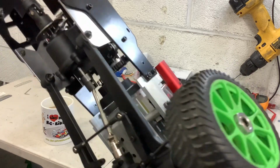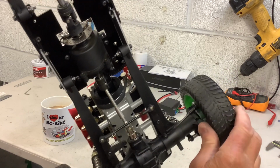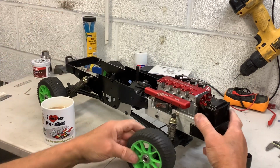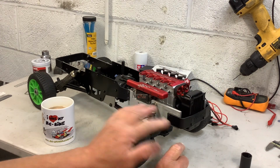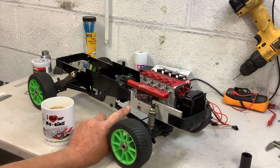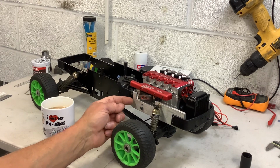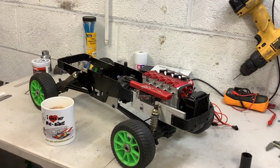So I've got to sort out the drive shaft. I had to cut and shut the drive shaft there, and I'm going to braze that, silver solder it. So at the moment, it's not gone bad. If it looks alright, I'm going to have all these bits anodised black, so the whole thing will be black. And I'm going to put another alloy piece in here, so this carries on into there, and bolt it from there into there. This has got a step on it, so when you do these screws up, it locks on that, so it keeps it from moving.